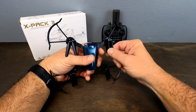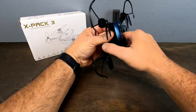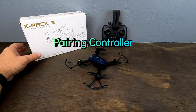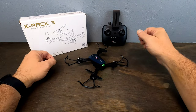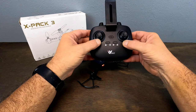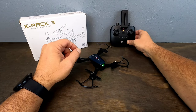This is how big the drone is with the propeller guards on — pretty big, but still small enough to fly in your living room. To pair the drone and controller together: power on your drone — the LED will blink red and green. Then long-press the controller power button — the LED starts blinking red. Take your left joystick, push it up and then back. Your drone's LED goes solid, and the controller LED also goes solid — you're paired.